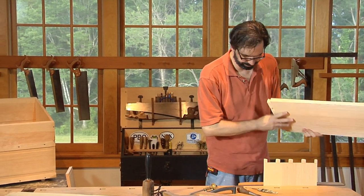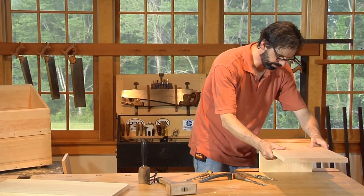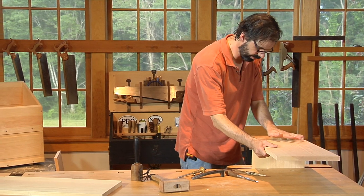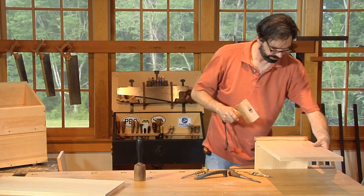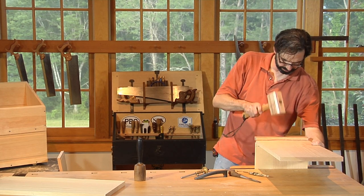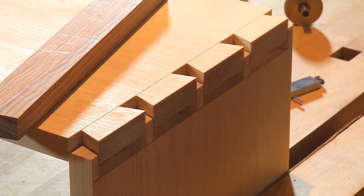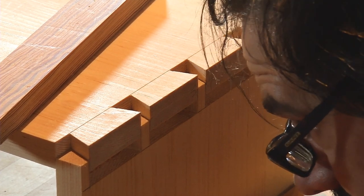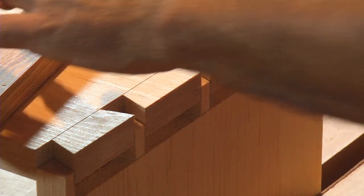Make sure that's clean. Put it back in place. Put the beater block on there — usually it's good to use a harder wood. That started just fine. So now I'm going to take my mallet and drive it. We got back to where we were. I looked down there and it didn't crumble anymore and we're about halfway in now. I'm going to continue and put the joint together completely.